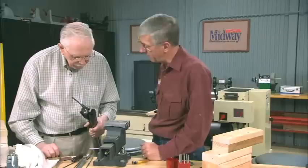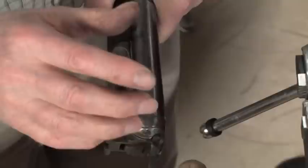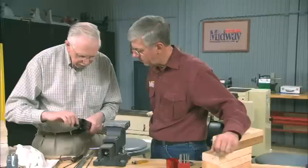I do need a clearance between the flats here from about halfway along the action to the corner. But as long as I've got a clearance there, I'm not going to worry about how much it is, not with a gun of this quality. I mean, as I say, the main thing is having it on the face. And with this thing, if it was a Holland, I'd be concerned if I had a big gap there or something, you see.